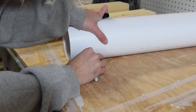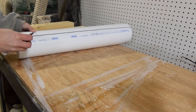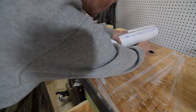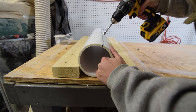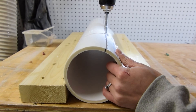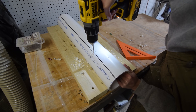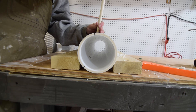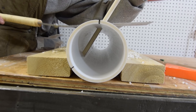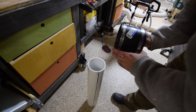To build the box or steam chamber, I used four-inch PVC pipe and rubber gaskets to connect and cap the chamber. I drew a line all the way down the side of the PVC to mark the location for some half-inch dowel rods that would serve as interior shelves. Then I measured and marked the end location for the mirroring shelf mount on the other side, positioned well below the mid diameter of the pipe. With the marks in place, I used a half-inch Forstner bit and a rough jig to place a few shelf mount holes on either side, then placed a few shelf racks throughout the steam chamber using half-inch dowel.